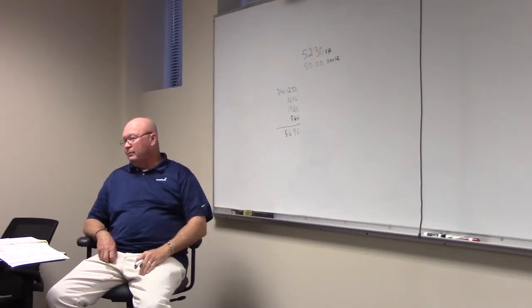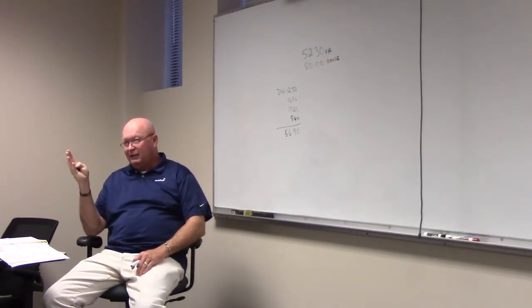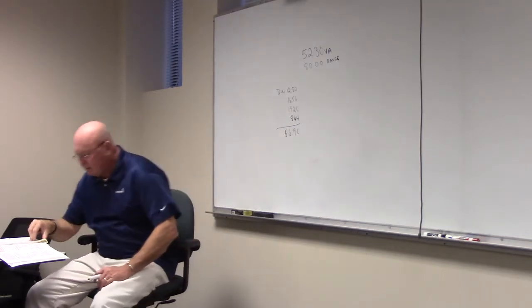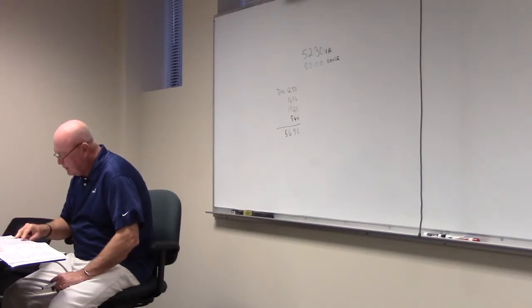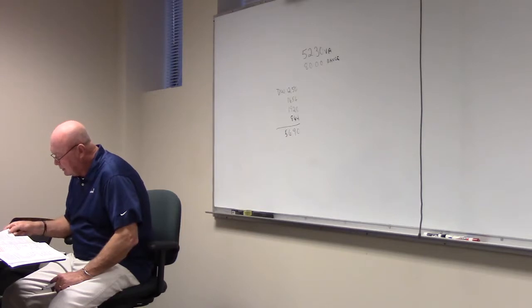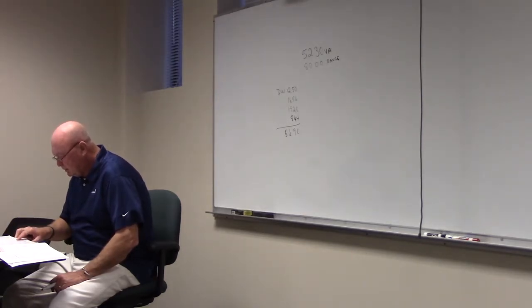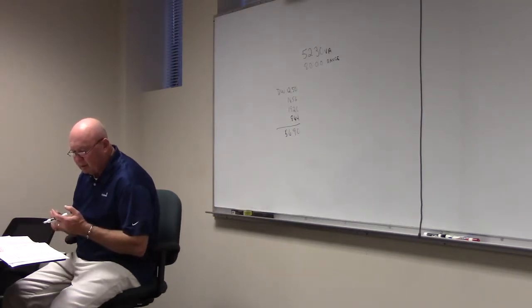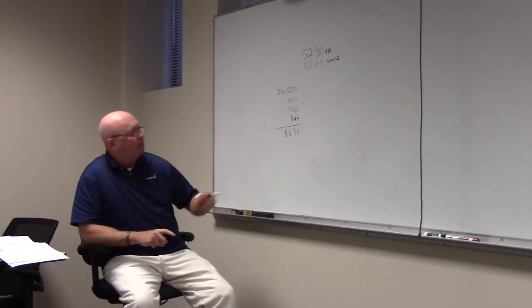How many appliances we got? 4. So, with 4 appliances, what can I do? Turn back to 220. Let's go back to 220. You can deduct it. Very good. 75%. And why? Because it tells us what? 4 or more. We can do it by, how much was the percent again? 75%. Okay? 220.53 shall be permissible to apply a demand factor of 75% to the nameplate of four or more appliances, and all those were fastened in place. A dishwasher, a disposal, a pump, and a blower. All those are fastened in place appliances. So now we're going to take that 5690 and we're going to multiply it times 75%.